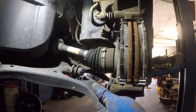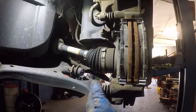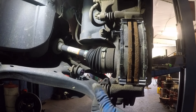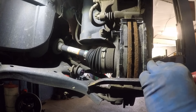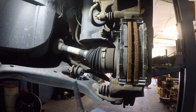Next we're gonna grease these pins up. This one seems jammed up a little bit — it moves but it's stiff. What you need to do is bring that out and clean it up. You can take a pry bar and hit it with a hammer on the back end. Be careful with that rubber boot — you can see the condition of this one is terrible.